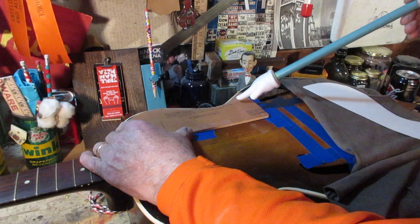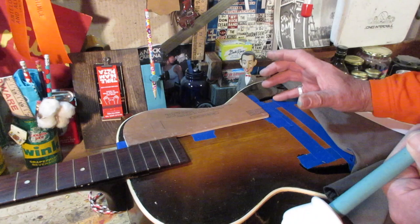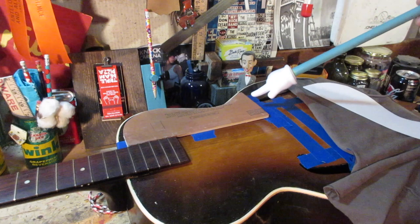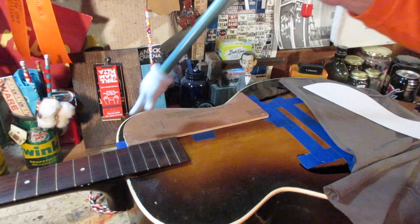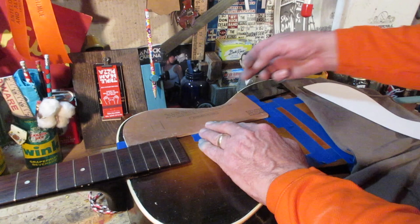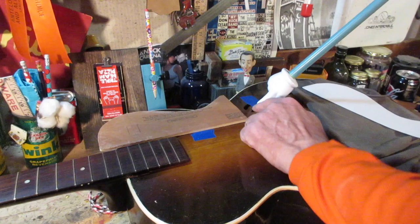You notice that most people that play archtops use a grounding point. They'll put their little finger on the bridge or something like that. They all do it. So I don't want anything that's going to be right in here. And remember, the closer I get to here, the less room there's going to be, because I can bend the bracket that's going to come up here and this one to some extent to get this to arch up. This is actually going to have to arch up like so. And then I'll use a thin body potentiometer, and then you can see where that line is. I'm going to put that right there. You can see that all I have room for is the wires to come up out of here.